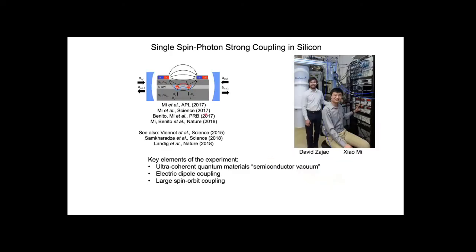What we want to do is target a single spin. We'll work with silicon because it offers very long spin coherence time and spin lifetime. We'll use an indirect coupling mechanism that's stronger than the direct magnetic coupling: electric dipole coupling combined with spin-orbit coupling generated by nanomagnets fabricated on top of the device. Setting our double well potential in the fringing field of these micromagnets means that as we move the electron back and forth, the local quantization axis of the spin cants slightly—coupling spin to position, like a spin-orbit interaction.